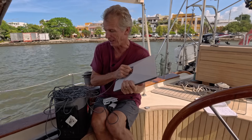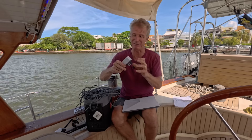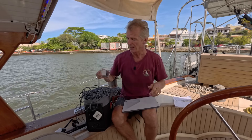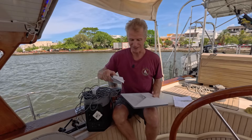It is a bit of a shame that on a 12-volt boat you're not really going to be running it straight off your batteries - you'll have to have some system in the way. For the old Starlink, we fitted a Phoenix inverter from Victron, which is a nice efficient small inverter. We don't have the ship's inverter on that often so it made sense to do it that way. For the Mini I could do the same, or I might get a transformer so it can stay DC all the way through. But it's using about half the power of the standard version, which is a really good plus point.